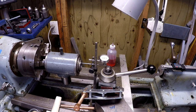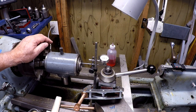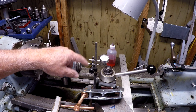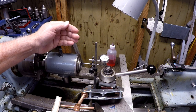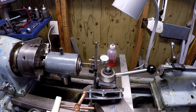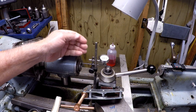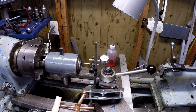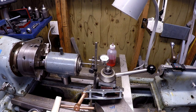In an effort to determine the taper on this tool, I've set up a back-plunger indicator and have it centered in the bore. This rotates, but the bore is steady — it's sitting in the three-jaw chuck, so it's parallel to everything. The indicator is centered, right on the end, and I'm on zero. I'm going to use the DRO to move one inch and get a reading over one inch to see what the taper is.